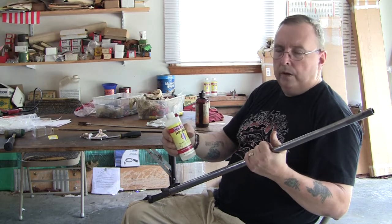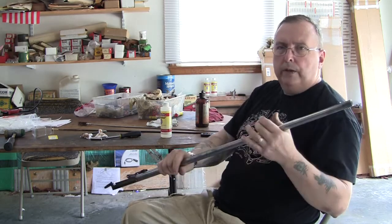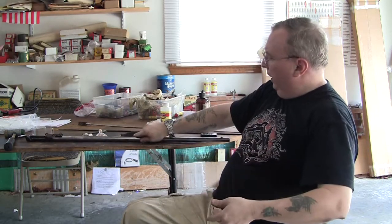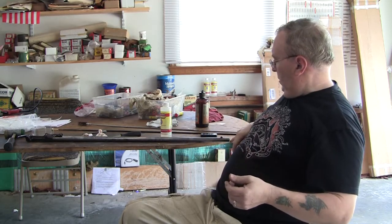We tried this wipe out, no lead, where you just paint it in there, let it set, and it should come out with just a patch. Well, the buildup in these trapdoors can be so great, like 5/1000ths thick leading, which is in here. This stuff does work. It goes in as a clean liquid, bubbles, you let it sit in there, and it has removed sections. This area here has light pitting all towards the muzzle. Nothing horrible, but very light little pitting, which was invisible, which means that this has taken the lead deposits out of the barrel. And from standing out in the sunlight and looking down the end of the muzzle, the last inch or so has a black residue, and you can see where this stuff sat there in little spots of it, like the higher ends of the edges of the bore.